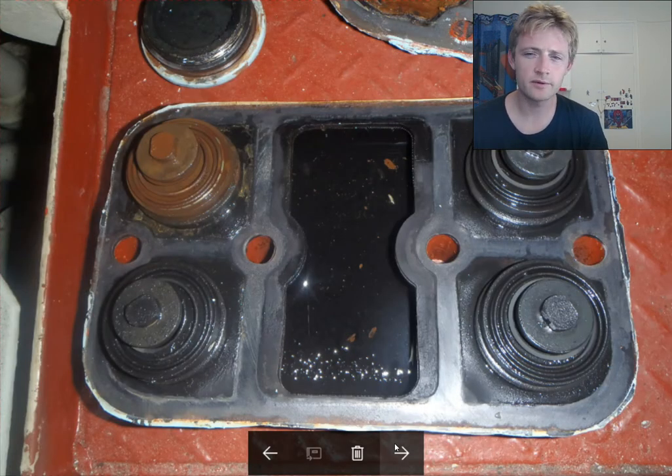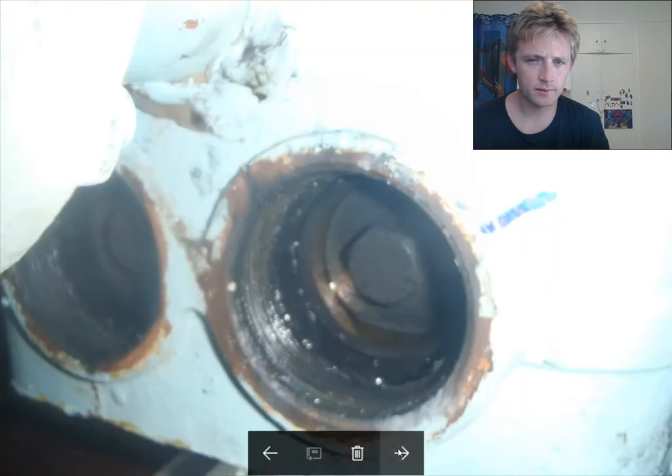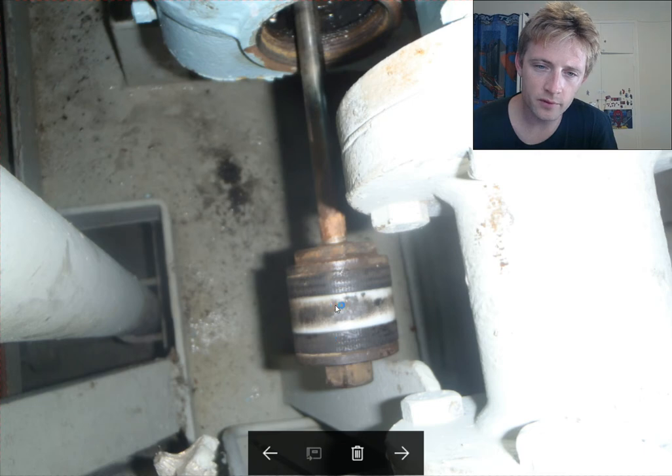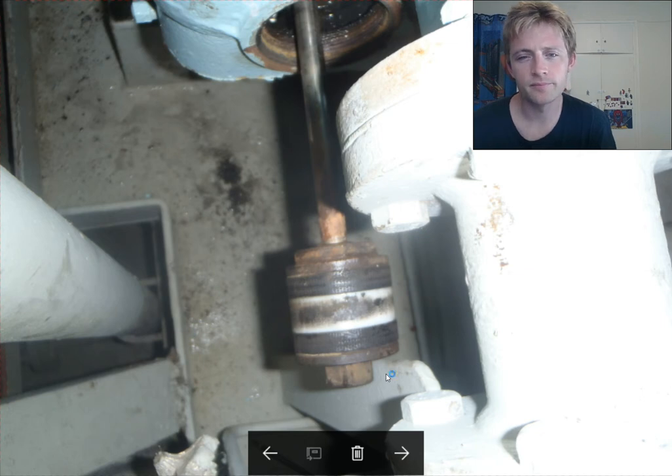Always remember to have spares for this kind of pump. This pump is similar to the sludge pump in most Korean-built ships. Here is the piston, which in one stroke pushes the liquid and in the other stroke suctions the liquid. There is a Teflon here and some sets of rubber — two pieces here. You can turn this with a spanner; if I remember correctly, it's 17 or 19.